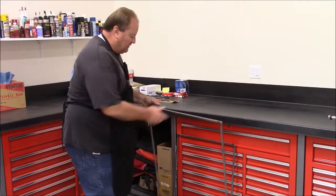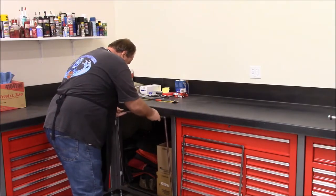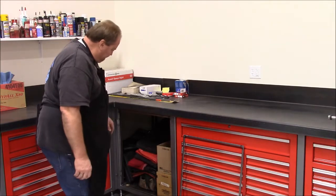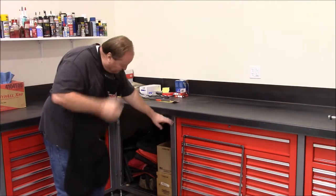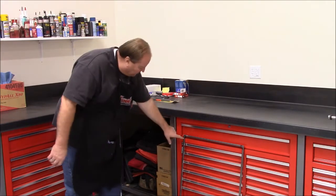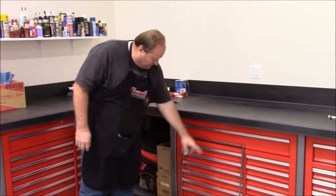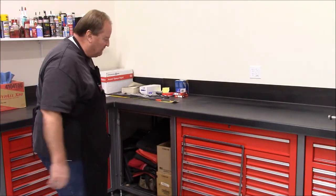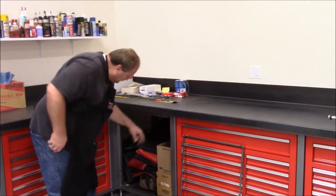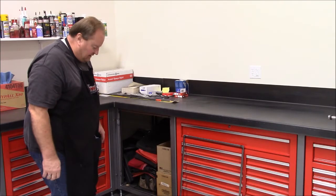Alright, I got my two frames done here and I got the hinges on them, so I've got them all mocked up — kind of tucked in to the side here — that's how they'll sit. I'm going to paint them; I've got some hammered paint left. I'll wipe them down, paint them, then cut some aluminum to frame them and put some pop rivets around, about three or four per side. I'll probably get my bead roller out and put a bead four inches inside of them, running it around the perimeter.